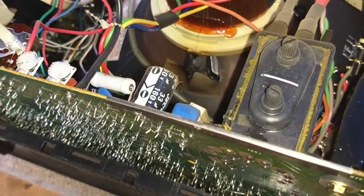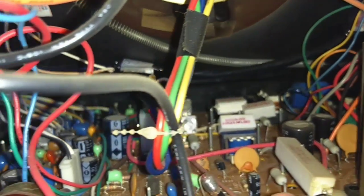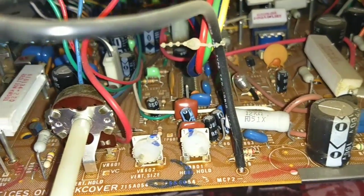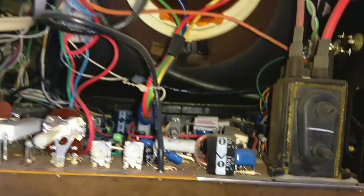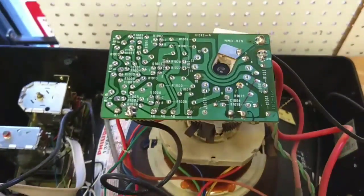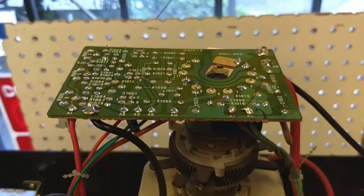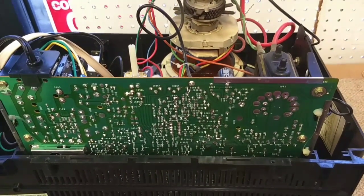33 at 160 — that's probably your boost filter. Lots of little pots and stuff back there to tweak. I think we'll re-solder the neck board, clean all the pots and switches, and fire it up. It's got vertical size, horizontal hold, and vertical hold — those are the only controls from the back. This looks like a pretty low-hour set. So let me do that and we'll get this thing fired up and see how it looks.